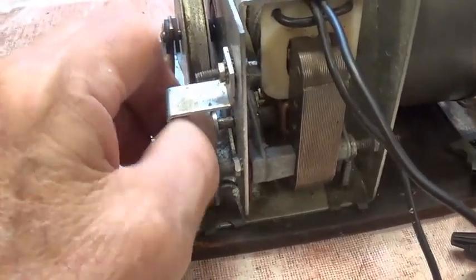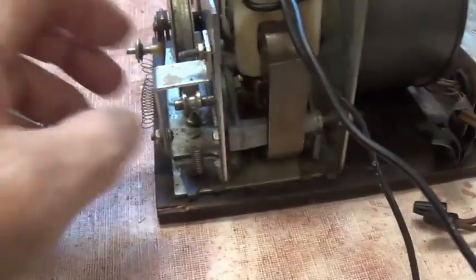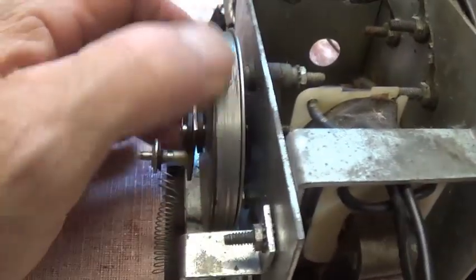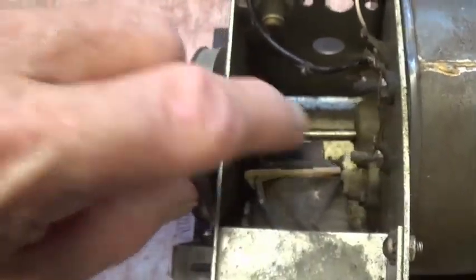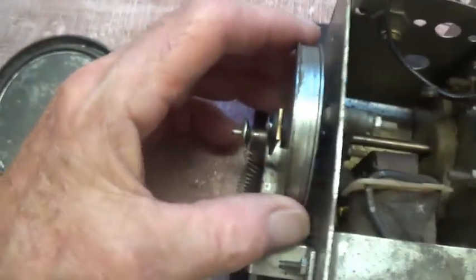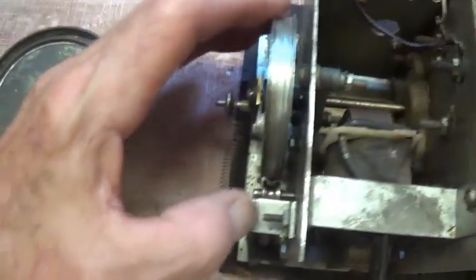Here's the small motor pulley, which works fine. I plugged in the two AC wires for the motor and it spins smoothly and quietly. And this is the pulley for the recording and reading wheel that's inside the drum over here. I think you can see it spinning. And it seems to have some resistance, probably due to really dirty bearings that are passing through to get into the can, so I may have to disassemble this from the shaft and try to clean those bearings.